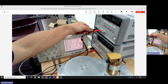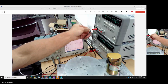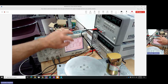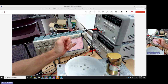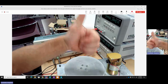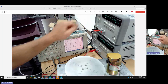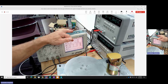If I were to change the direction, I'm going to change it by changing the voltage at the input of the motor. Now it's going the other way, in case you were watching the disc. Now on a rising edge of channel A, my channel B is high. Here I'm rotating counterclockwise, or we'll call it a positive direction, right-hand rule, thumb going up. Let's flip that again. We call it negative direction. On a rising edge of A, B is low. So we can tell the direction here.